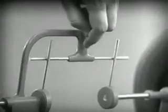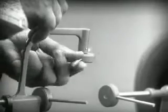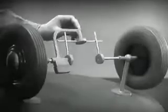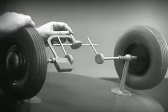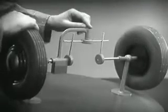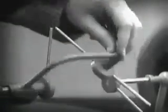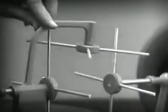Let's put this bar on a pivot, so that it can swing in either direction. Now the bar can still turn both wheels at the same speed. And because it pivots, it lets one wheel turn even when the other is stopped. But if turned too far, the bar will swing around until it won't drive the spokes that turn either wheel. We need another crossbar and more spokes to carry on the job.